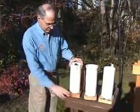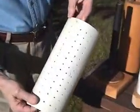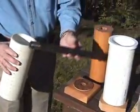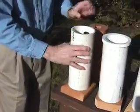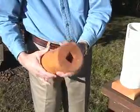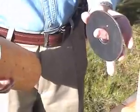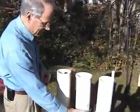The first mold set is the traditional mold set, which is a piece of four-inch PVC with lots of holes drilled in it. These are one-quarter-inch holes on three-quarter-inch centers. It takes quite a while to drill all these holes. The center rod is a piece of one-inch galvanized pipe, and the piston which goes inside is a round wooden piston that requires a fair amount of work to make. It uses a four-inch metal washer on the bottom, and then a washer in the middle so that you can make two briquettes at a time.